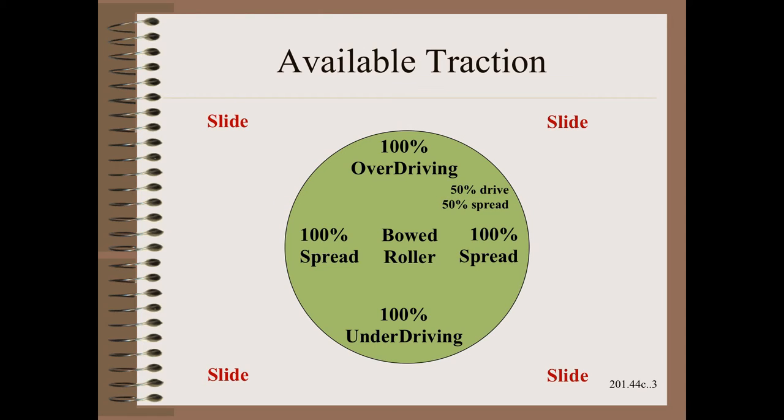In all cases of a mechanical drive slave to some other roller, the drive will be less than optimum and quite probably worse than no drive at all. Except in the extreme application cases such as tissue that must run in the bent pipe mode due to low, exceedingly light tensions and tractions.